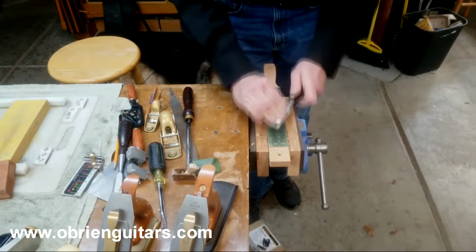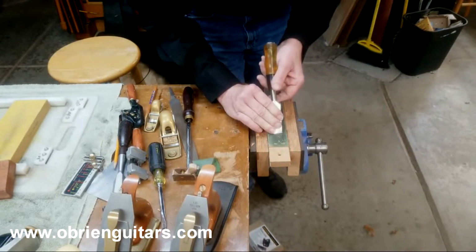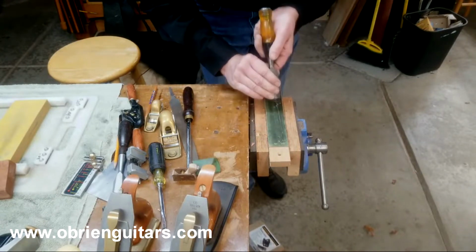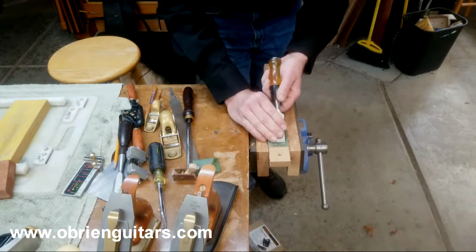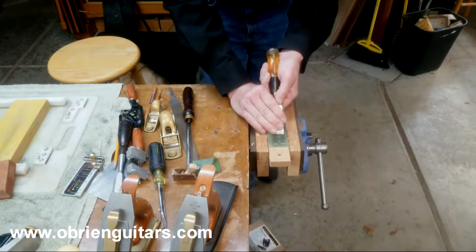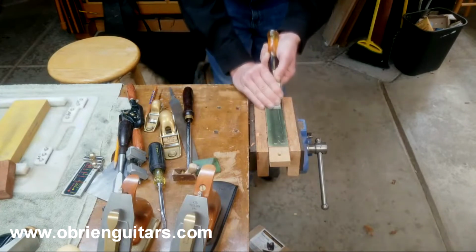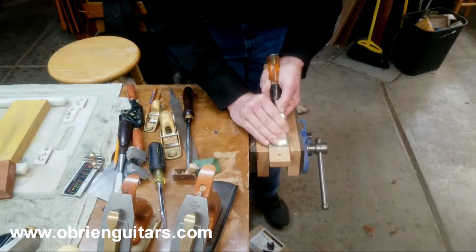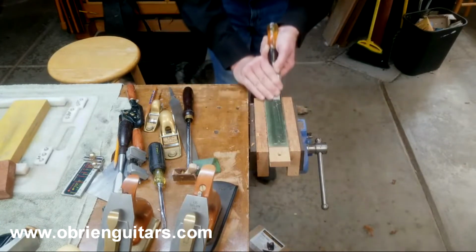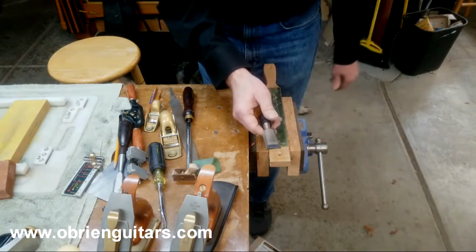And then on the front side, this is where it gets tricky. You turn it over and you want to find the cutting edge. When you find the cutting edge, if you just pull your hands back, you have a tendency to round that over. So the idea is just take a step back from the bench. I don't know if this is going to show up on camera here, but I just find the edge there, and then I just take a step back from the bench. And I walk back into the bench, and then find the angle, take a step back. I don't get too carried away with this because it's really easy to round over that front edge. But the trick here is find the angle and then take a step back from the bench. Now you've got a nice cutting edge that's ready to go in carbon steel.